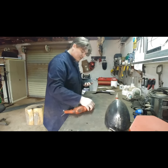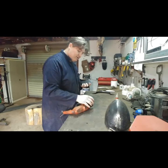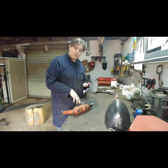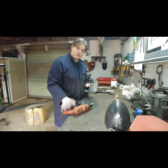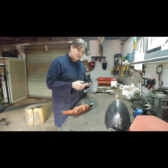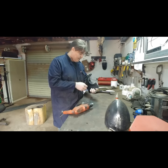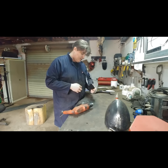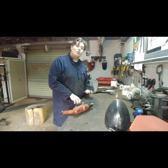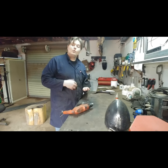For those who aren't familiar with drilling into metal, I suggest don't go in at full speed — otherwise you'll burn your drill bits. Just run it on the low setting if you can, or use speed control with your fingers so it runs slow. That way you're cutting into it nicely, getting good chip formation, and you save your drill bits. I'll finish up drilling all the holes now.